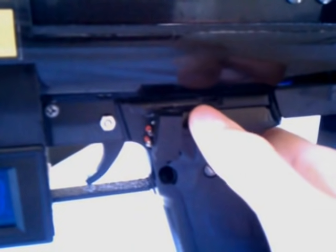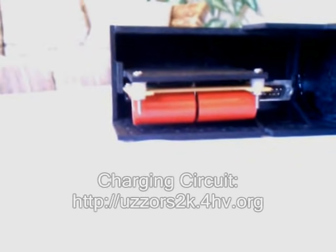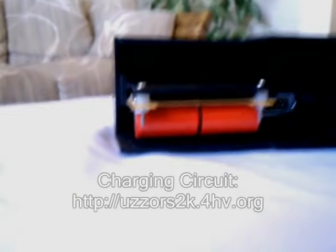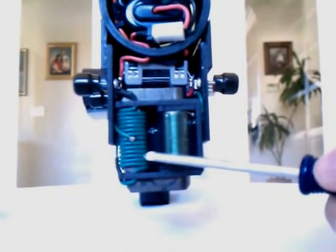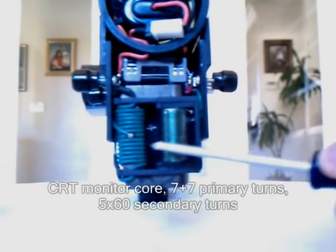The charging process has begun by flipping the switch over the handle. That sends power to the fore grip, which contains the charging circuit, which is a ZVS flyback driver. The flyback driver oscillates the primary side of the flyback transformer. The secondary side steps the voltage up to a high level, which is then sent through a bridge rectifier.